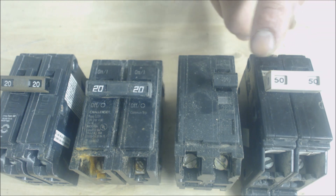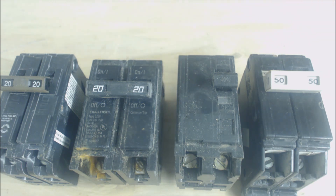As of 1995, Underwriters Laboratory no longer required breakers to have that HACR rating, because breaker manufacturers were making them for heavy duty use all the time. The National Electrical Code in 2005 no longer required the HACR label on the breaker to specify that it was for heating and cooling or other uses.